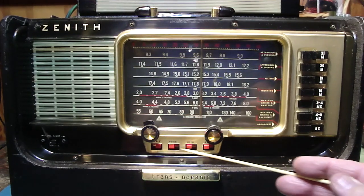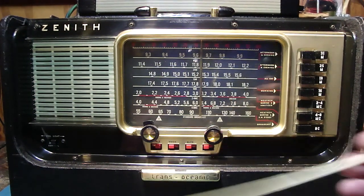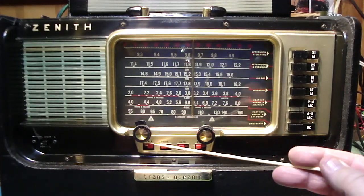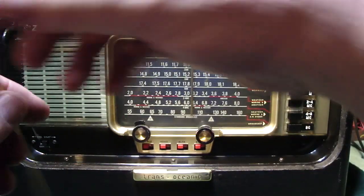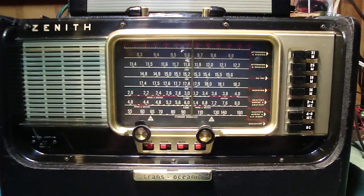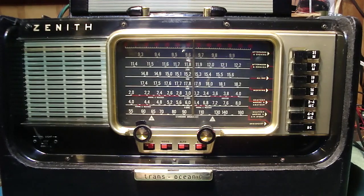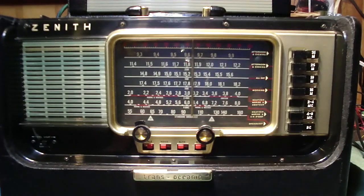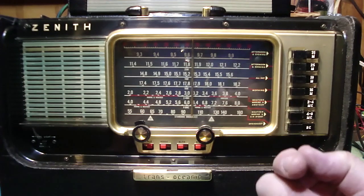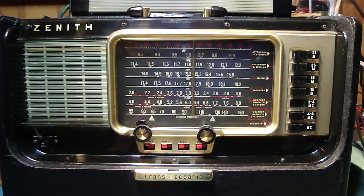Down here, where your treble, voice, alto, and bass controls are, these switches down here, what you want to do is now, with everything in place, tighten the chassis down. Have these centered so that they're in an equal position. I pushed the chassis back because it's still loose, so that the switches have about equal space on either side, and then push the chassis forward toward the front, and bolt everything down. Make sure you have these sticking out as far as possible, and also check your distances from side to side. It's just a little more attention to detail.